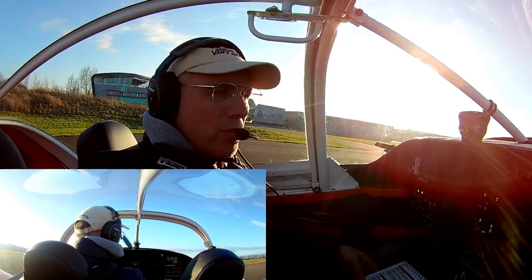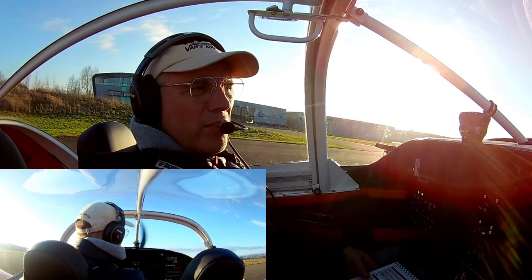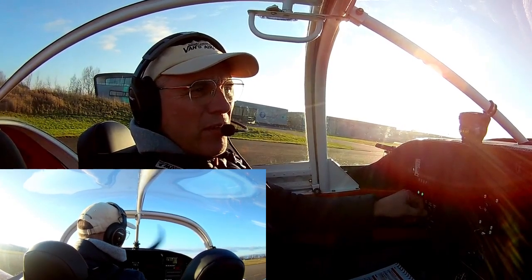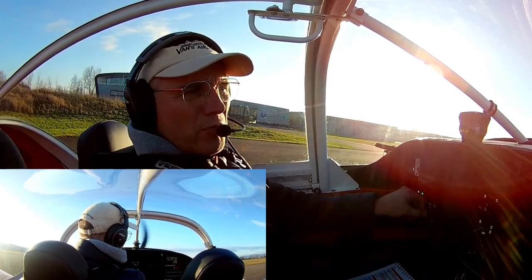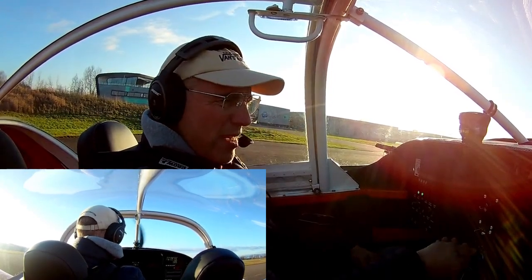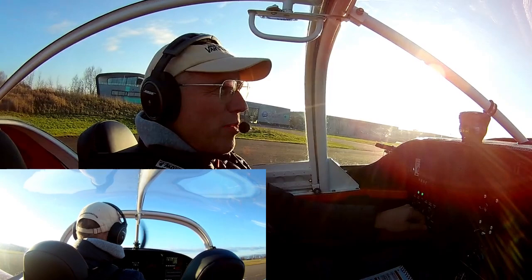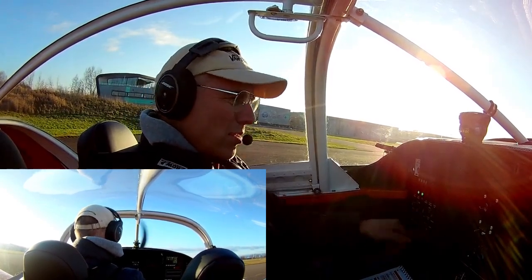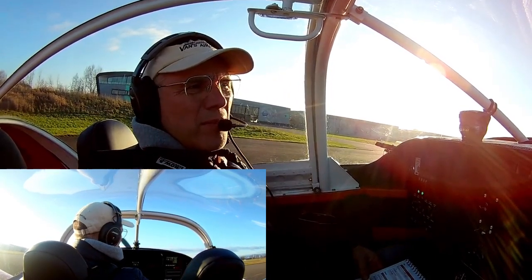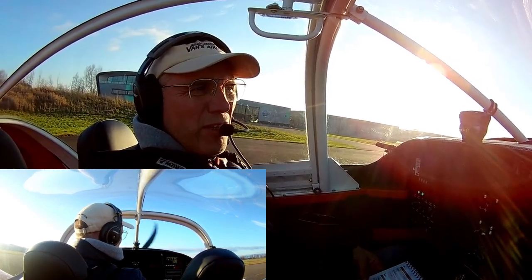I set the brakes, and I put the throttle up a little. I'm not going to do 1700, because I think the engine is still too cold for that. Let's do 1500, a little bit more. So I check 1. There's hardly anything, maybe 10 rounds per minute slower. The other one also. So the drop between the coils is very minimal, that's nice. I can put my controller to manual for the propeller, and I can put it coarser and finer. Let's see if it works. You can hear the RPM. So my governor works. Put it back to automatic. Back to idle, and back to 1000 RPM. That's the whole check. So as you can see, it's very quick, very easy.